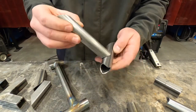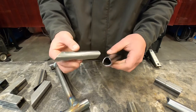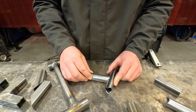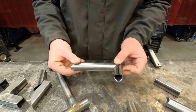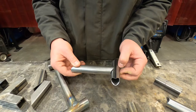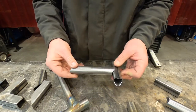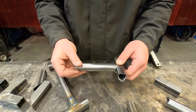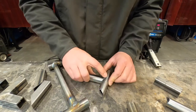When it comes to our T-joint stuff, whether it's a 45-degree angle or whatever, there are some things to think about. If we need to adjust or squeeze things for squareness, there's a tacking order that would be beneficial. We're going to put our tack right here on the furthest point of that coped edge, so if we need to adjust for squareness we're able to do so. For T-joints, I like to lay it flat and tack up on top, then flip it over and tack on the other side.